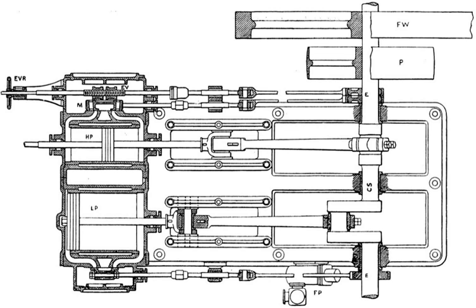The pressure of the expanded steam is less than that of steam supplied directly from the boiler. An engine working with an expansion valve set to an early cutoff is thus less powerful than with the valve fully open. Accordingly, the engine must now be driven so that the valve is manually adjusted as the load on the engine changes. An engine running under light load may be operated efficiently with an early cutoff, while an engine under heavy load may require a longer cutoff at the cost of more steam consumption.